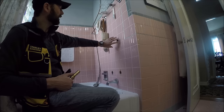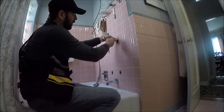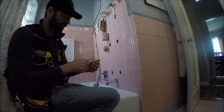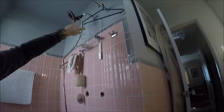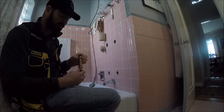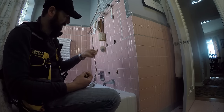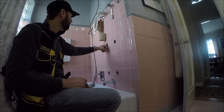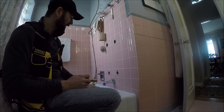This upper one, when they would turn it on, they'd get water coming out, but they had water coming out around the escutcheon and draining down the tile here — but they were still able to shut the water off. So to me that sounds like there's a clog up there at the shower head. This house has galvanized plumbing supply lines and they rust and will flake off and build up. You can see the rust stains in here — if I just stick my finger in here, you can see there's orange all over it. Rusty water. You would never want to drink the water out of a galvanized house.